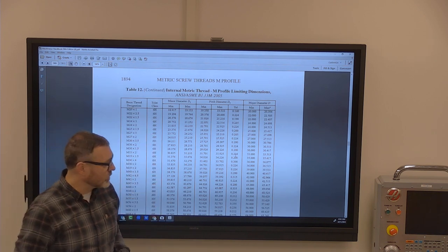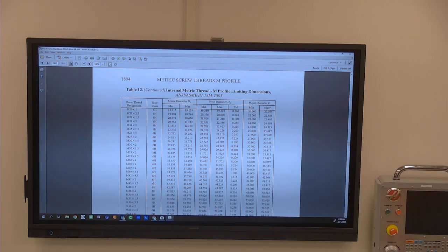If you have, let's just say you have four holes that you machine on a part. And you guys who are in metrology or who are going to be doing metrology, you'll talk more about this when you are in there. So let's just say I've got four holes on this part, and each has a position of 1 inch by 1 inch, and each one of these holes is a half inch diameter. If one of these holes is out of position, let's just say this particular hole is actually 15/16ths this way, but it's still 1 inch this way.